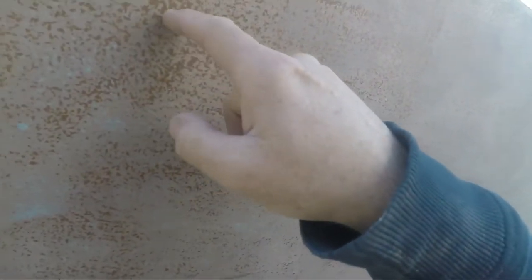Come and have a look. I'll show you. So this is the sanding job up close and personal. You can see the gray is the Interlux Interprotect. The light beige is actually what it's supposed to look like, and the dark is where the epoxy is still intact without exposed copper. The product sheet says that it should look about like this. So some spots are perfect, other spots are not good, but I'm just going to leave it like that for fear of taking off too much copper coat. It's only about 12 mils thick, so you don't have a lot of room to work with.